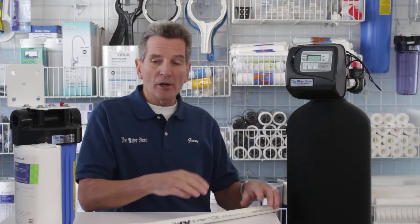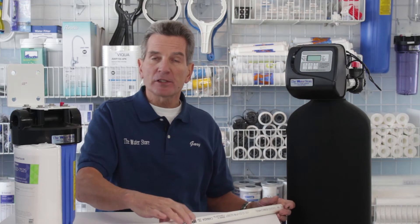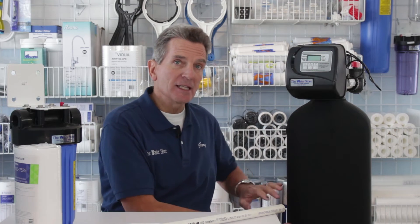After about five days it needs to clean itself, as it's accumulated all the sand inside. So at a predetermined time — programmed in, usually 2 a.m. — it automatically goes through a cycle. You don't have to push any buttons or touch anything; it just does this automatically. When it comes time to backwash, water goes down through the middle, down through the riser tube, out through the filter, and pushes the media up — expanding it from half filling the tank to totally filling the tank. That opens up the media and flushes all the debris and sediment out to the drain, then it rinses the media, settles it back down, and puts it back into service.